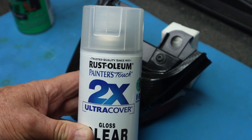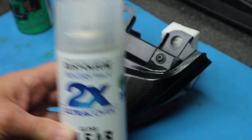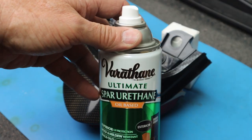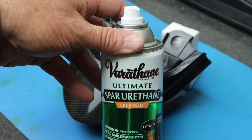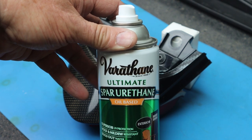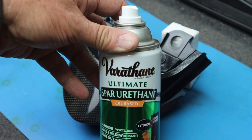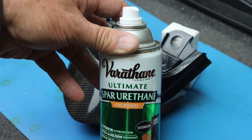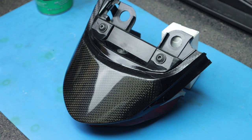So what I did was sand down the finish again with 320 grit, then I came in with a Varathane Spar Urethane. This is oil-based — you may be able to get oil-based in your location, though certain parts of California you can't get oil-based and have to get the waterborne. Anyway, get the Varathane Spar Urethane, put five coats on, and let it cure for 48 hours.